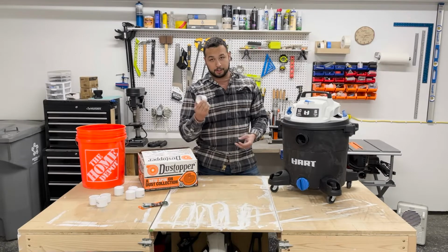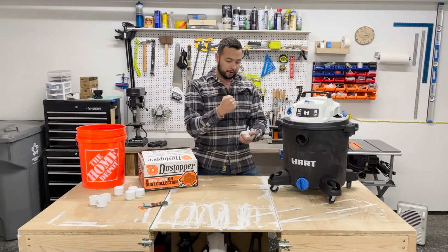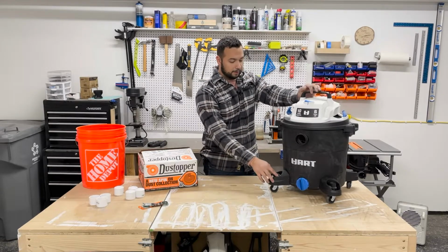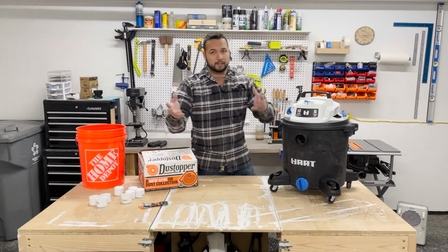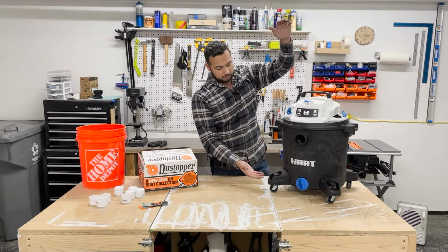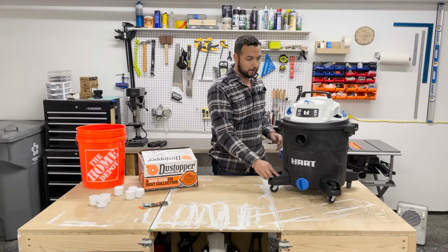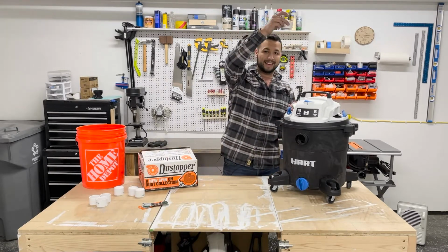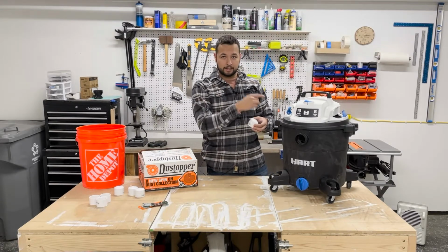So I'm just going to use these 1.5-inch couplings, and then I'll drop that 1.5-inch ABS pipe right in there. And in all 4 legs, that should be pretty strong. So essentially, that's what the assembly is going to be. We will cut our 1.5-inch ABS pipe, and then we will insert it into the coupling, drop that down in there so it's seated all the way down, and then we will put an end cap. In the top of the end cap, we'll have a bolt that attaches it to the plywood top.